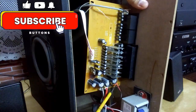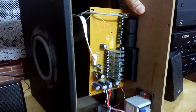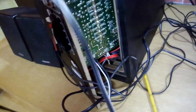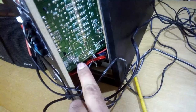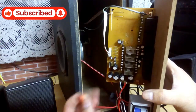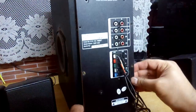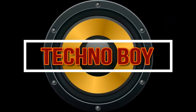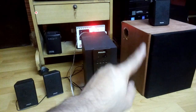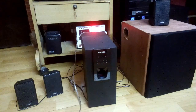I'm going to remove this card from the socket and solder a new wire for connecting the subwoofer. Here it is — I have connected a long wire to this subwoofer connection. I removed the jack for the internal subwoofer, and now I've connected the 8-inch subwoofer's output. It has 8 ohms and the three channels are there. I'm going to connect it to my mobile and check the sound.